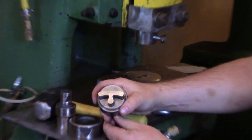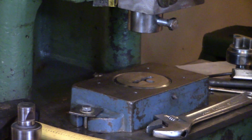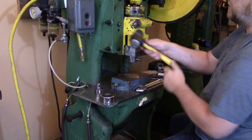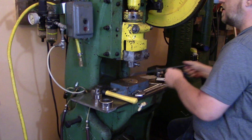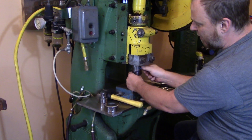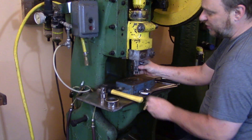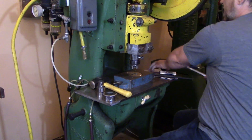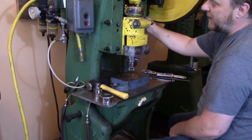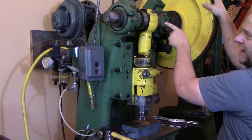You can see the shape — not round. So here we have the die. It's already broke free, we've got that loose. We're also going to loosen up this hammer. Make sure that's broke free. So first we're going to put it in there and kind of just eyeball it loosely. We're not going to crank down on it yet — just make sure it's secure and it's not going to fall out. But you can see I've still got some play in there because we're going to need that play to get the clearance lined up. There is a clearance between the punch and die that allows for the breaking of the material. So what we'll do is just cycle it by hand — I'll pull down a little and then I'll engage the press by hand. This allows the crank to come down. You can see the crank motion here. There's a cam inside that crank that allows for it to come down.